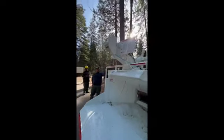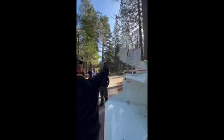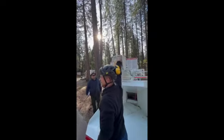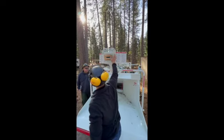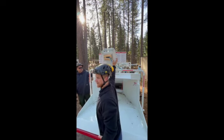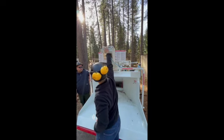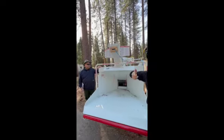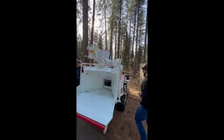You said there was some grease points. Oh yeah, I'm sorry. You're 100% right, guys. He just mentioned I skipped over these. You've got 2 little bearings up here. Just a couple shots every day, guys. It's nothing crucial. All that's doing is lubing this plate up so it can slide back and forth, or really just as needed. If you see it's getting tight, just shoot some grease. You've got a point there. All of our grease points are going to have caps on them right now from paint back at the factory. So that's what you see up there. Thank you. I skipped over those.